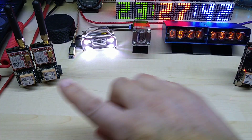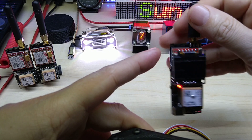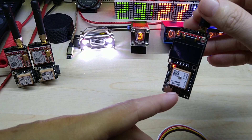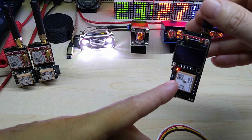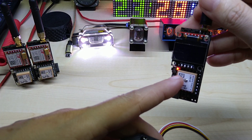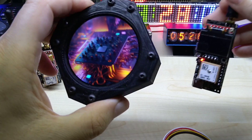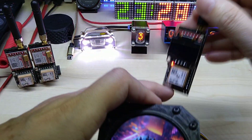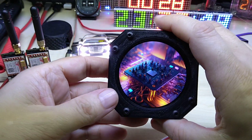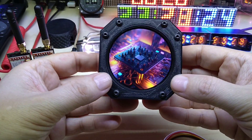Speaking of GPS — these are actually GPS and GSM trackers I'm working on. The latest code version I have: once it gets a GPS fix, you can set a geofencing distance in the code, and if it goes out of that area it sends you an SMS. It will also work the other way around for location tracking.